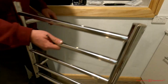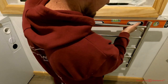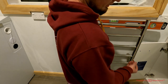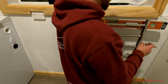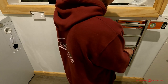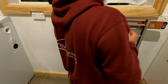Next, line this up with the wall. Throw a nice level across the feet and line your centre points up at whatever height you want for the towel rail. Just check that cupboard doors and drawers don't open up onto the towel rail. Make sure it's level and do a small semi-circle around the top of the feet for each foot to mark the wall. Be careful not to move the towel rail while you're doing this — sometimes it helps to have a second person. Line it back up perfectly and keep going.